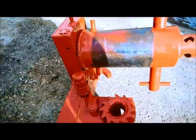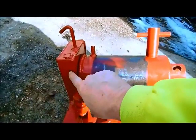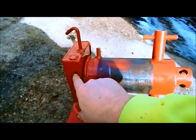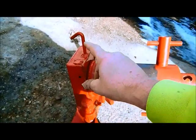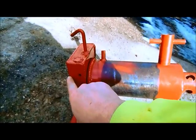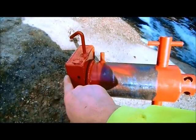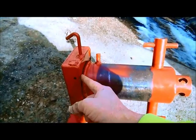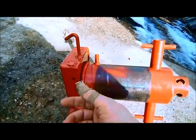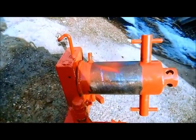One thing I need to tell you: this quarter-inch hole — make that hole whatever size you need for whatever screwdriver you find that fits — but it's an inch and a half down from the top, and it's an inch and three-eighths from this side. I would have measured it from here, but they've got a weld here, so depending on how thick they make that weld, it could change the distance.